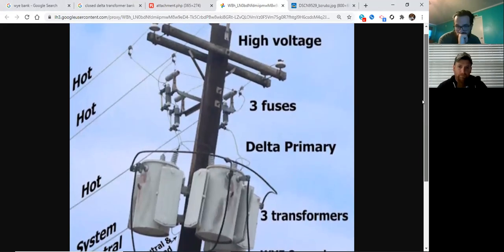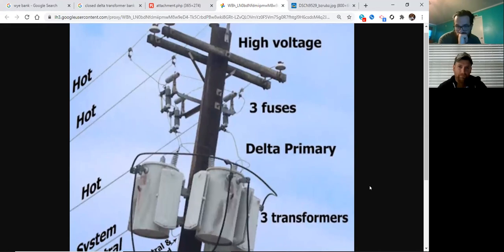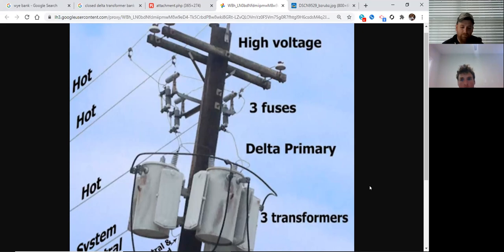Oh man, shoot. I gave the answer away. I hope you didn't see that. What kind of bank is this? So use a little bit of reverse engineering right here. Do I have a lighting transformer? First, where should the lighting transformer be? Middle. All right, is this a lighting transformer? No, it won't power a house. I've only got two wires coming out of it. What kind of bank is it? A wye. There you go. Fantastic. All right. I did it by deduction.